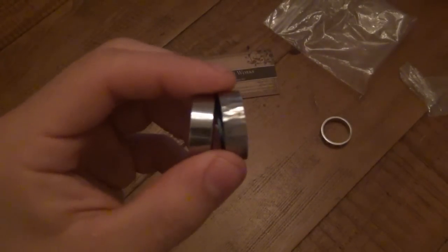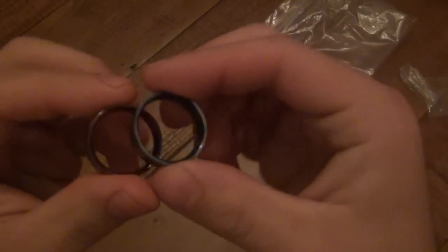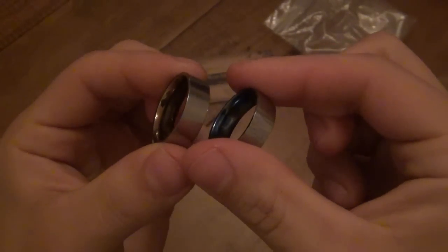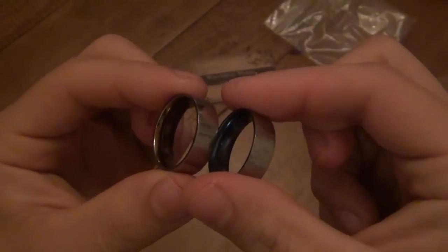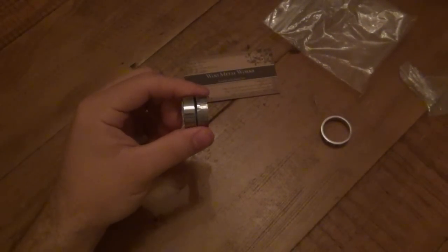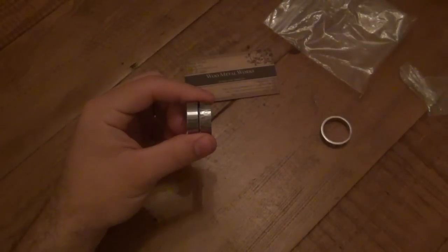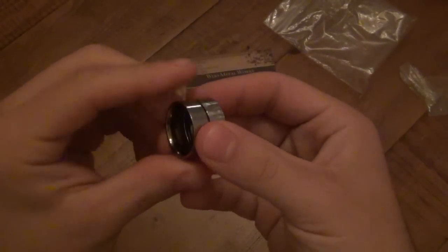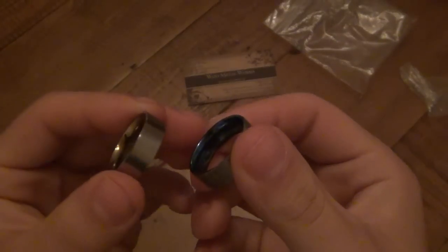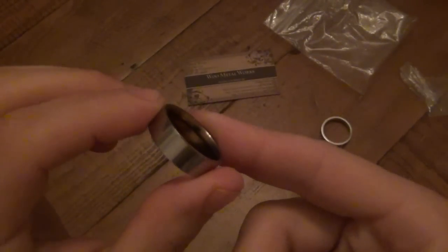I'm not specifically a jewelry person per se, but I tinker with everything. Some days I'll want to wear titanium rings; the next day I'll have no interest at all. I'll put them in a drawer, rediscover them next month, and go 'oh yeah, these are awesome.' I'll take some close-up shots because this video is not doing justice to the anodizing, which is beautiful. I believe it's heat anodized, which gives you a little more of a spectrum as opposed to electrically anodizing, which uses a specific voltage and gives you a more consistent, specific color. A lot of people do heat anodizing — it's a little easier and you get that array of colors. This one is mostly sapphire blue but has a little bit of greens, and the other one is mostly gold on the inside but you also pick up some reds, purples, and a little bit of blue.